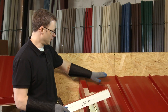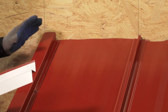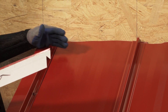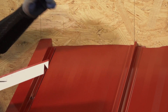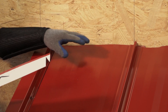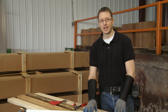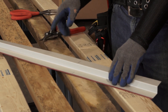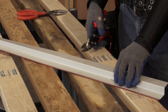In some cases — for example, on this first panel — we have a gable trim that is sticking out into the panel, so you'll have to adjust the width or length of the Z-Trim accordingly. I'm going to mark the Z-Trim, cut it, and then install it so we can install the end wall trim using stitch screws. The cutting of the Z-Trim is straightforward. You can see my pencil marks where I've had it up on the roof and made the measures to fit in between the panel and the gable trim.